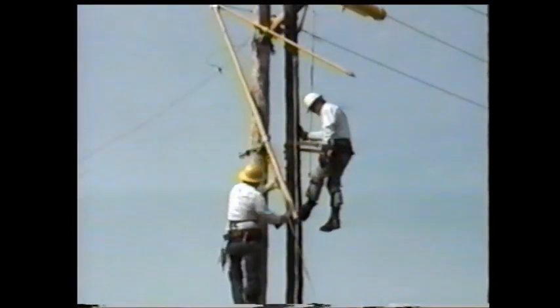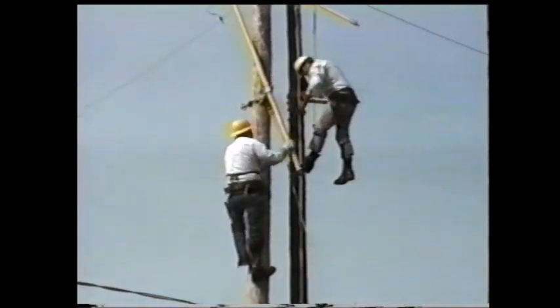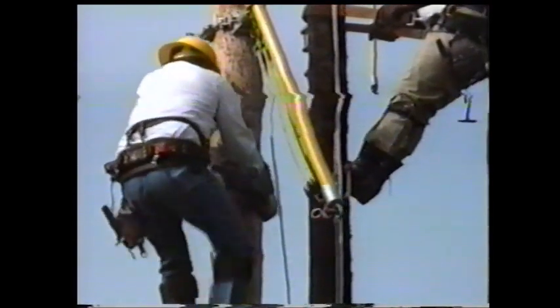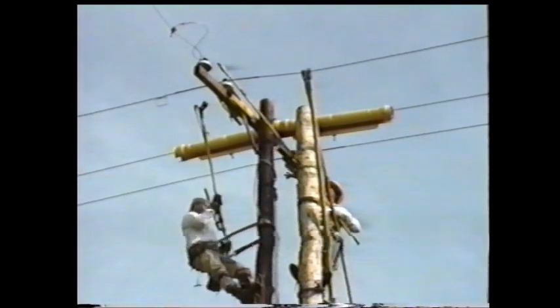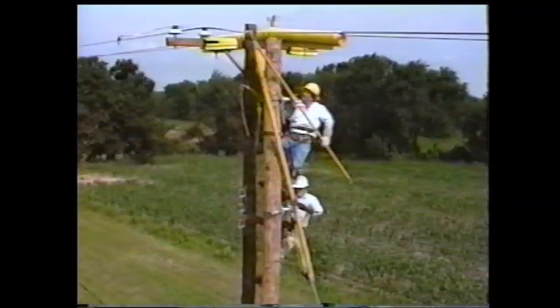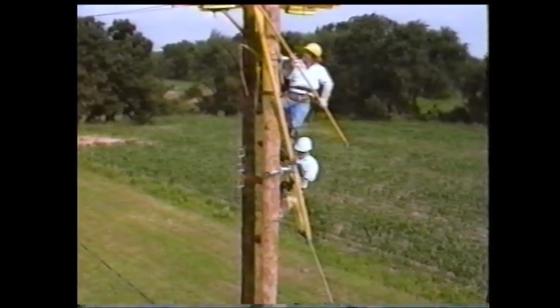The fall end of the rope blocks is placed into the clevis on the pole saddle, and the other end of the rope blocks is attached to the butt swivel of the 2.5-inch wire tong. This will be your lifting device. The conductor is untied by using the rotary blade attachment. Excess wire is controlled by cutting the loose ends. After removing the tie wire, the conductor can now be moved.